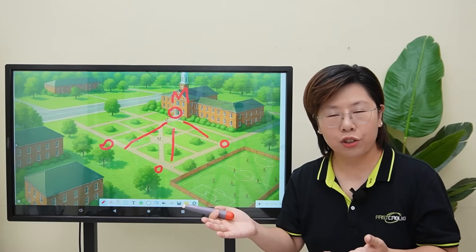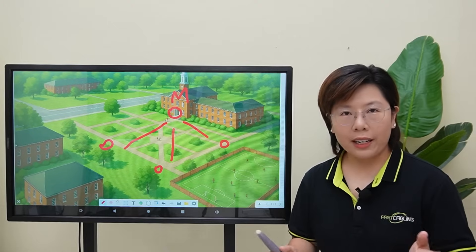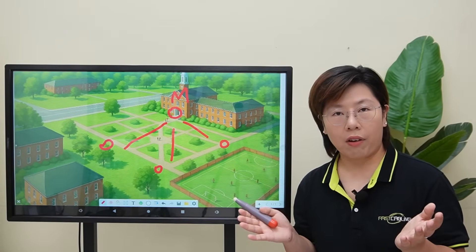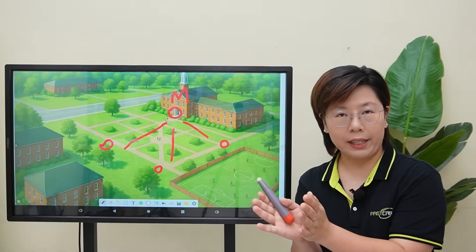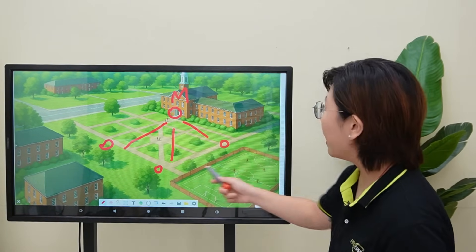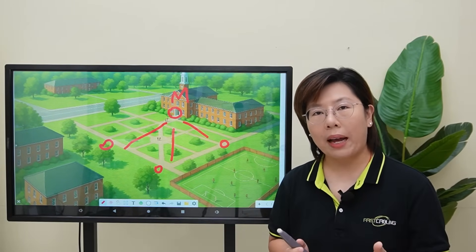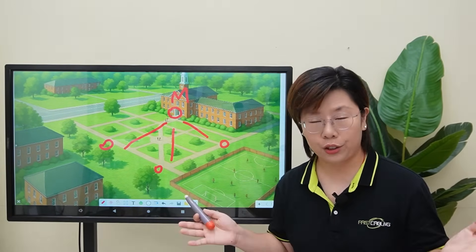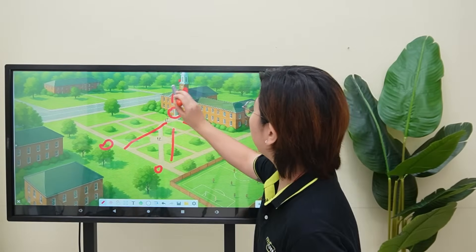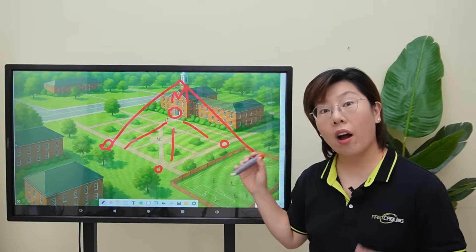They repeat their connection locally so they can carry video back to the master. Traditional wireless bridges often use narrow beams that cover a slice of the horizon, often around 30 degrees. That's great for a single link but not so great when your cameras fan out around the campus. A 90-degree horn lets one master cover a broad sector, often replacing two or three narrower setups — with one sector covering an entire side of the campus.